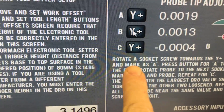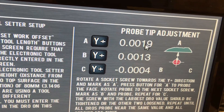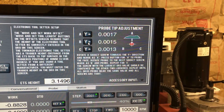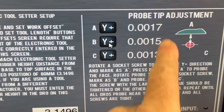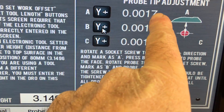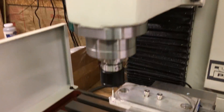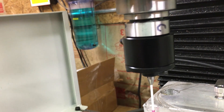So I'm basically working that down. All you do is, they got some instructions on here — trying to get these three numbers as close as possible to each other. This is how close I was able to get it. I've got all one thousandths here. That one's a little higher — we're just talking like two tenths of a thousandth off in between. When you're turning the screws on this, you're just turning it like maybe a sixteenth of a turn or something.